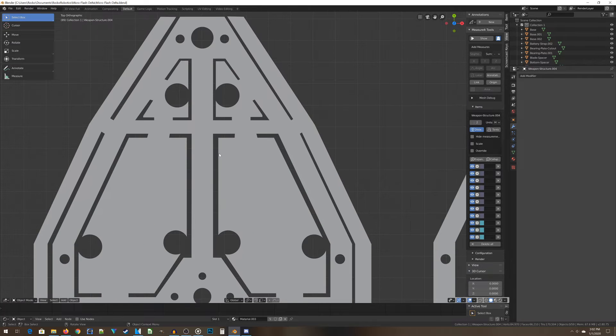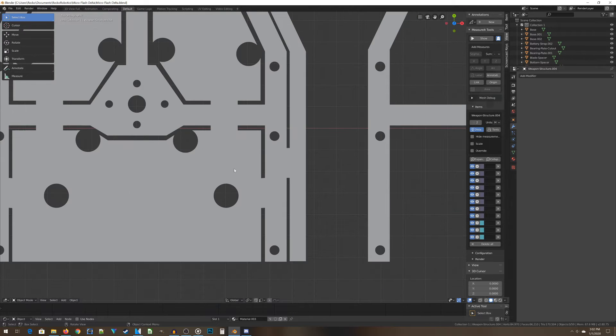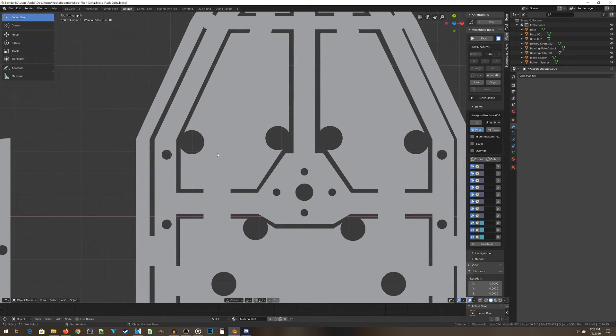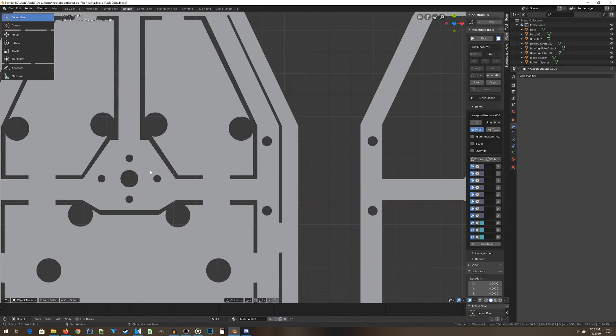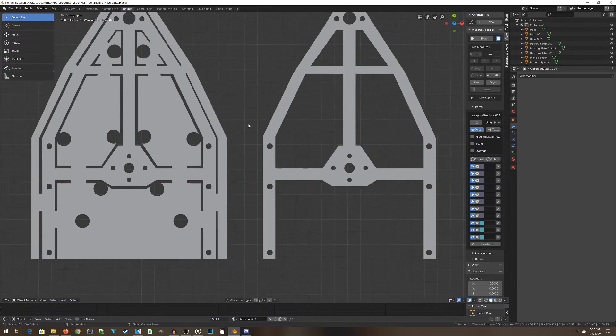There are two little tabs that hold the interior regions to the actual frame piece, so when you go to cut with the jigsaw, you're going to slice these open. I've also added several circles — these openings are in the interior pieces — and those are areas where I'm going to drill out to give the jigsaw blade access. These holes have to be bigger than the jigsaw blade. Along the frame itself there are little grooves as guides for where you want to maneuver the jigsaw.